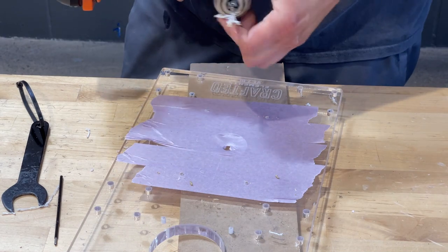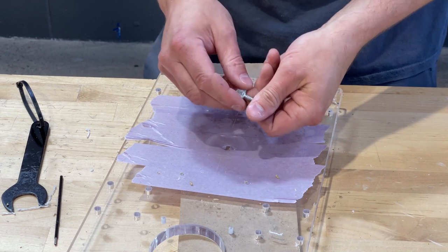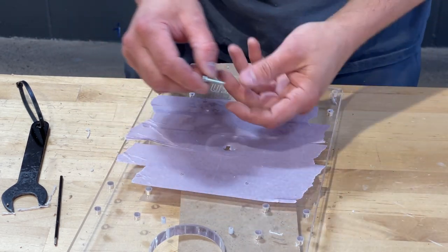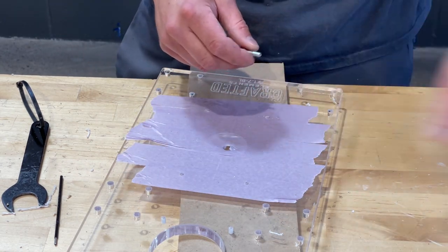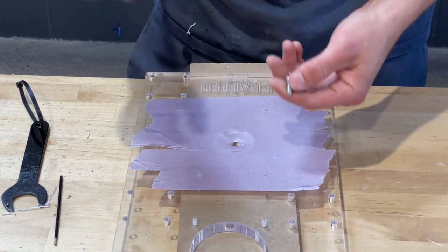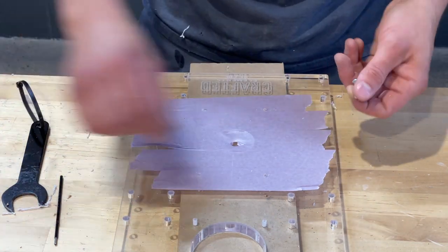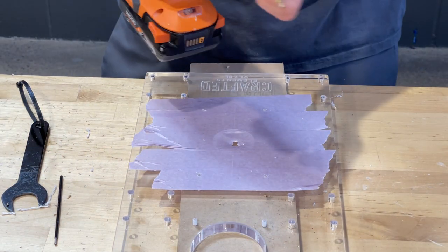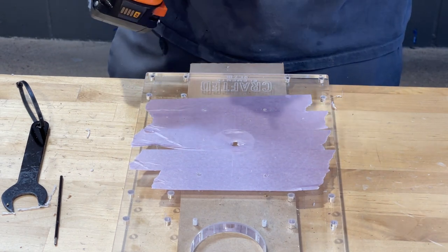What bit size diameter do you go to? That depends on your router screws. A lot of times you can get the screws from the router itself, or if it had a plate or was part of a router table you may have longer screws. If your screws are really short you'll need to get new ones long enough to go through the base plate. There is a trick if you're in a pinch — if the screws are a little too short, you can countersink the holes, which we'll show in a minute. The hole diameter is really just dependent on whatever screws you're using to attach the router.